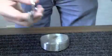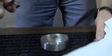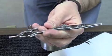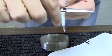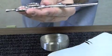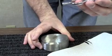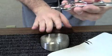I just wanted to go ahead and show how — at least I'm going to try this in the video — to see if I can hammer this back in. Because where it's bent way back here, it would be very difficult to get into any kind of a bending block. I can't use a scissor press because it's hollow ground, and sometimes I'd use a press to press set back in but I would ding either side of the hollow. So I'm going to try hammering it in with a heel dolly. This heel dolly is something you can buy from an automotive supply store — it's what they use to bang dents out of cars.